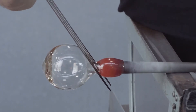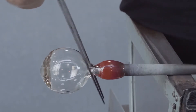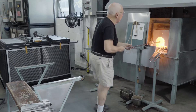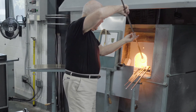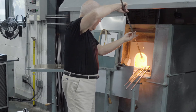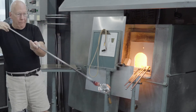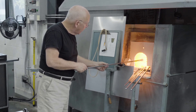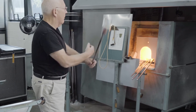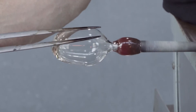The neck is further refined — made smaller in diameter. The shoulder is made longer and more tapered. This will allow it to break cleanly and easily. This beaker will be transferred to a punty. The blowpipe is held downward to elongate the bubble. It's spun to elongate it further, and the angle of the sides is set. This beaker has slightly conical sides.